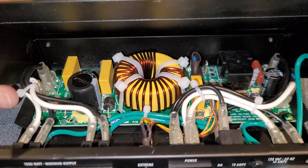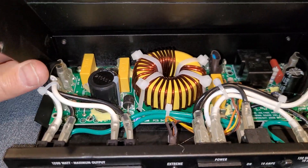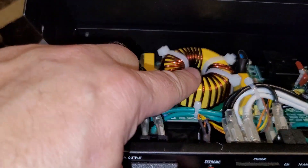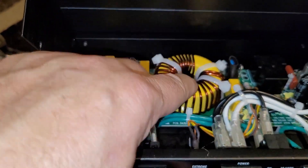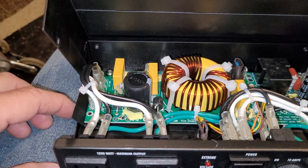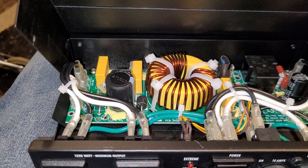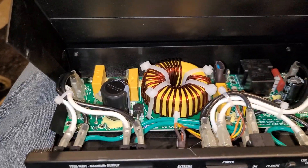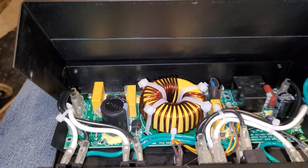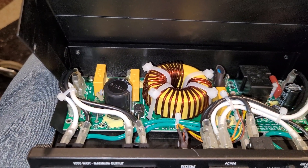When you open up this unit, this is what I really wanted to see. When you open up a power conditioner, there's some conditioning going on. I would imagine this is a ferrite ring, and the AC power goes over it, which is what you would expect. There's some other filtering as well. I opened up one of my other Furmans, and there was like one capacitor in it, and that's it.